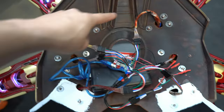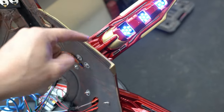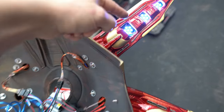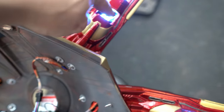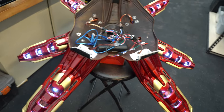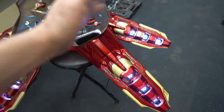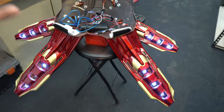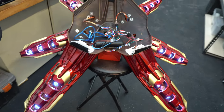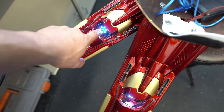So like I was saying, I have the jumper wires going into it — it's just a spider harness going into six, and then I have them daisy chained, so seven, fourteen, twenty-one. So if I ever change this spike and adjust it to be a different color, all six spikes will do the same thing. I don't think I'm ever going to want them to do different things, but now I can code them to pulse or flash and all six will do the same thing, and I only have to code one signal wire. Super simple. The last thing I need to do now is make covers for these, but I don't think we're going to see that in this video.